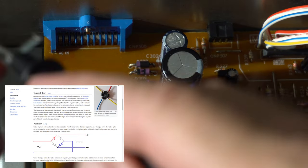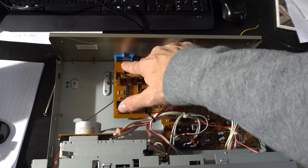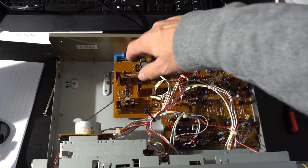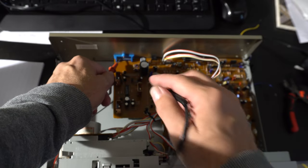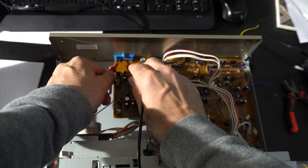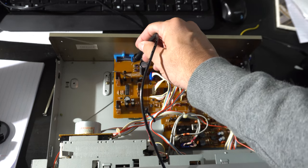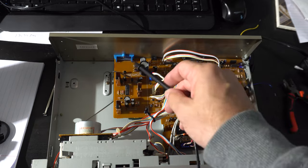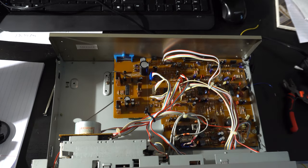Let me get this on continuity. This says ACN and I've determined two of the pins go to two pins on the diodes. The third pin goes here to those two diodes and the fifth pin goes here. So we've got AC coming in here, and DC should be coming out the other side out of two of those pins. We're going to look at the bottom of this board and see what else is hooked up because there's a bunch of connectors there.